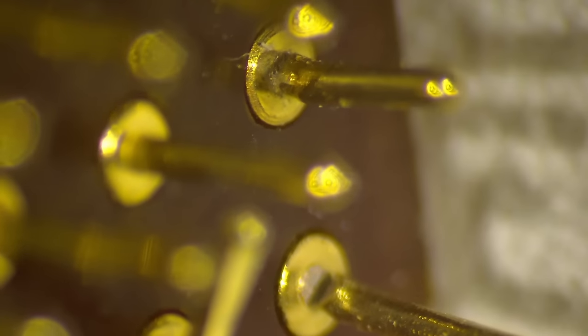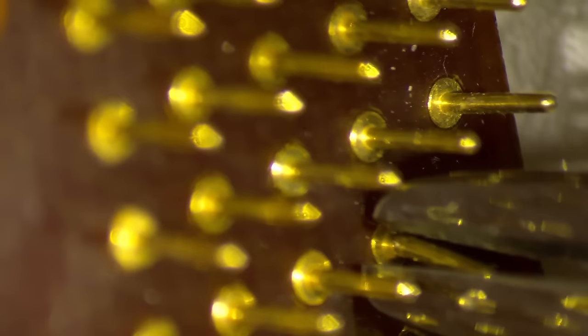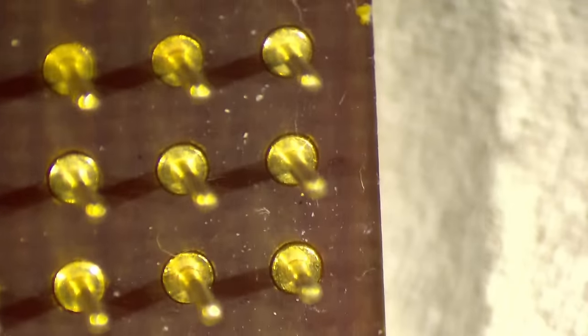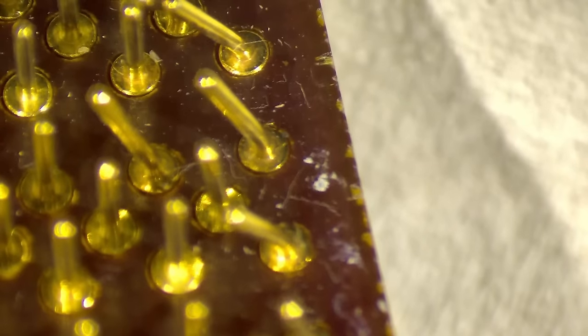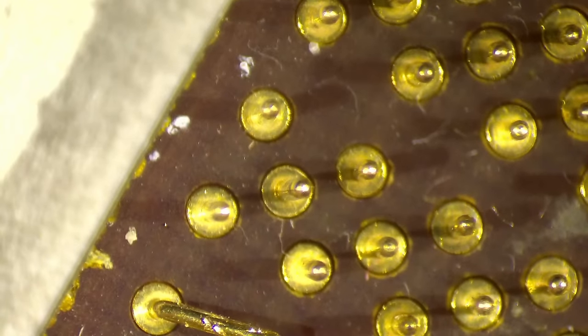But we need to fix the CPU — there is absolutely no way I'm going to scrap it. As long as they're not bent at the base I think the pins are fine. Let me just finish all the pins that need to be straightened. This one and these three in the corner need to be replaced. Are there any other pins that are badly bent? Maybe these ones I can fix, and probably these ones too.